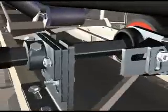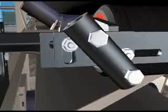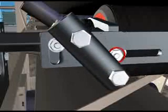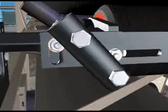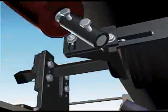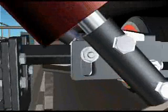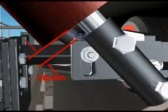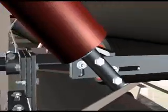Before inserting the wing rollers, align the sliding brackets perpendicular and to the outer edge of the flat bar. Tighten the inside bolts completely but partially tighten the outside bolts, thus allowing the sliding bracket to swivel. Insert the wing rollers into the bracket ensuring the end of the shaft is flush with the bottom of the bush and the wing rollers clear the flat bar by plus or minus 10 millimetres, thus allowing the rollers to rotate freely.